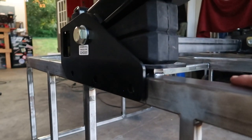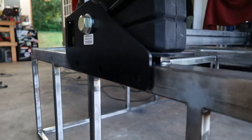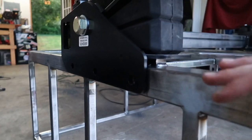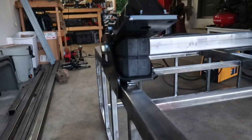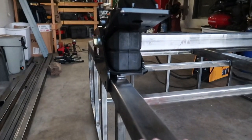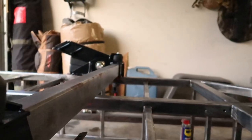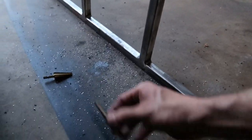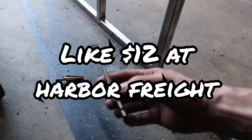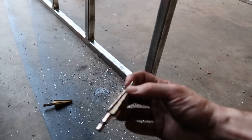Now that we know where our axles are going to be placed, we're going to go ahead and drill our 6 holes — 3 on each side — to be able to bolt them to the frame. Once those holes are drilled I just have a couple more little bits of welding and then I can work on painting the bottom of this frame before I flip it back over. Got all our holes drilled — I clamped the axles in place so they wouldn't move and used some step bits, which I highly recommend. They drill way better than trying to use a half-inch bit straight — you get a little pilot hole and then it just quickly steps up. I also drilled the holes to bolt the support bar in between the timbren ends.